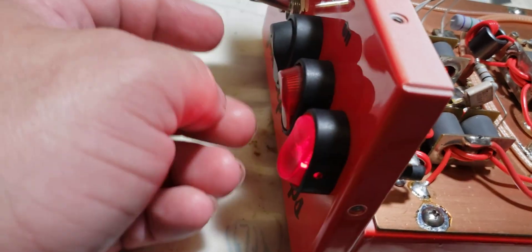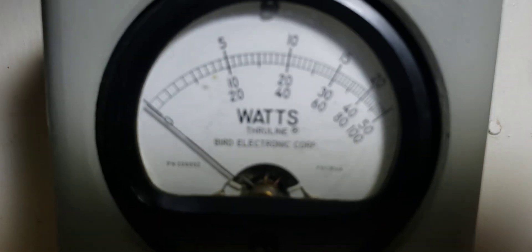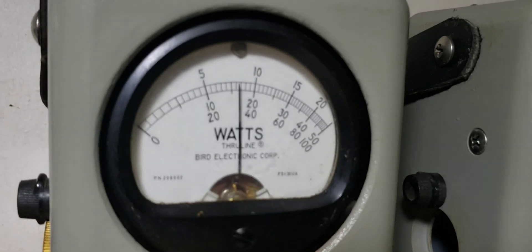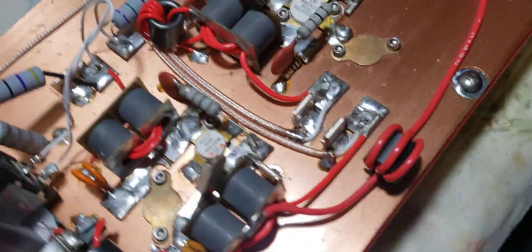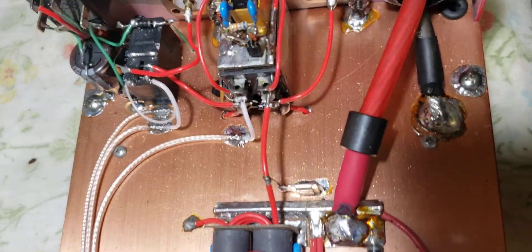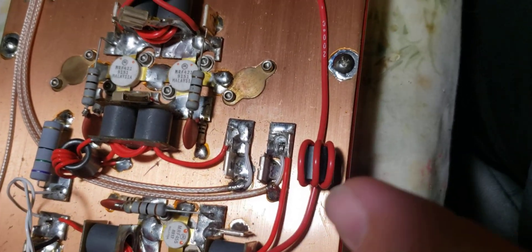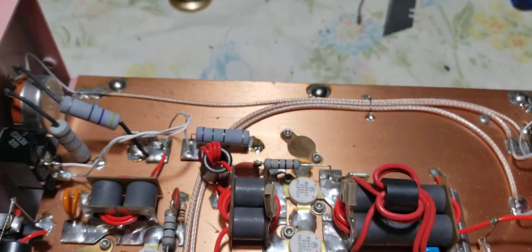We'll turn that variable back up. I forgot to show the input reflect — 5-watt slug. Beautiful. Alright, now just the two-pill section; the one transistor section is bypassed. I kind of like the way I did this — this is the first time I've ever put the pads right here, and I like the way this works without having to send another coax this direction and around the relay. I'm going to take pictures of this; every once in a while I'll do something like that and I like to take note of it for the next go-around.